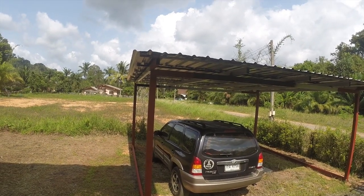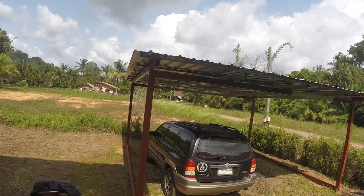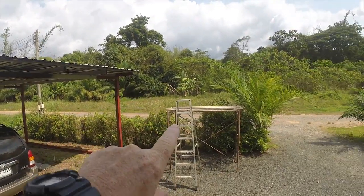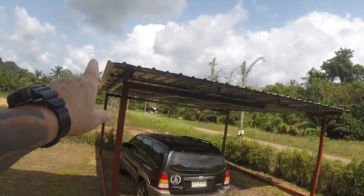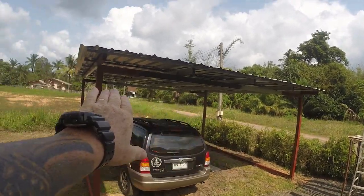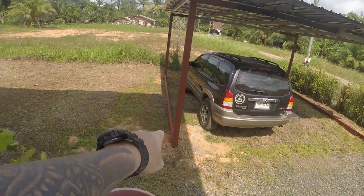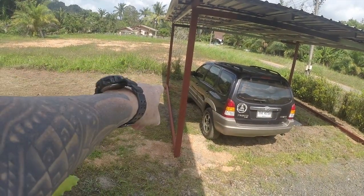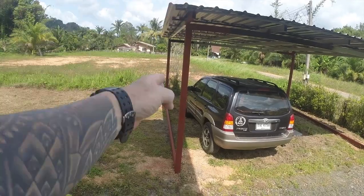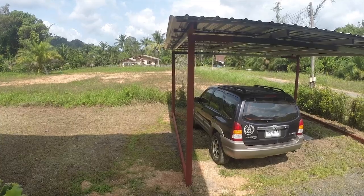At the end of it we'll go through the costs. All I've done this morning — it's getting too hot now — is use some red oxide primer to paint them all, and then I'll get up and do all that lot. It's got to have a bit of dressing and I'm going to put conwood across there and conwood across here, and my slatted fence is going to go there. I have two spare beams and I've got to put the lower ones in and then I've got a channel up to the top for my horizontal fence.